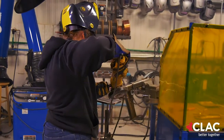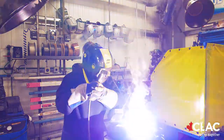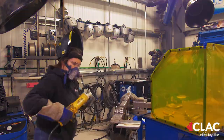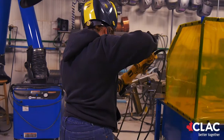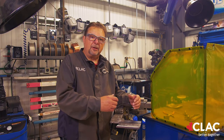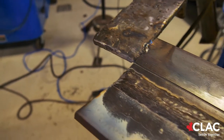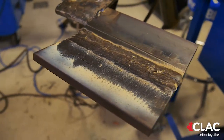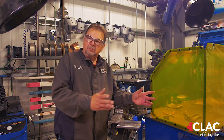Now we've had two layers put on the plate — that's the max you put on. You can't put any more than two. What happens with hard facing or cladding is if you start trying to put too much buildup on, it does what we call spalling — it'll pull out in chunks from the parent metal because as it shrinks, it keeps pulling up. You can see cracks on the surface of the plate; that is stress relieving. It has to do that, otherwise it will spall out.